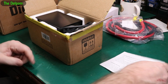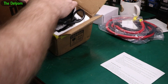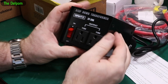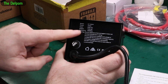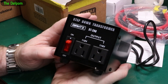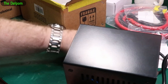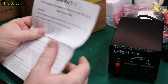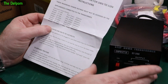This is something I got because I thought it could be useful. I saw some of these online and the power ratings on them were ridiculous — they were dreaming. We've got a couple of spare fuses in there. It's a little mini 220-to-110 volt converter. Input is 240 volts on this one, 110 volts out. Obviously it doesn't change frequency, it's only purely a voltage change because it's basically a transformer inside. Nothing too special. This one is 200 watts rated, which is fine if you're just doing small stuff — like a charger or something like that.